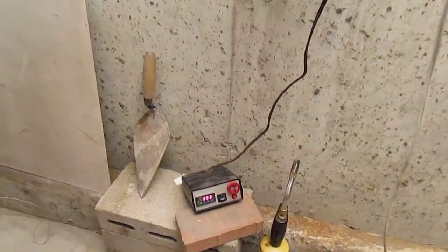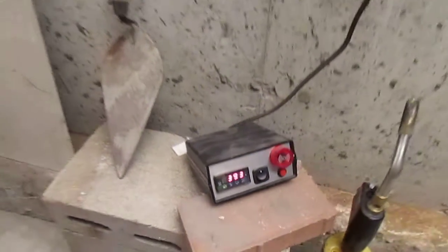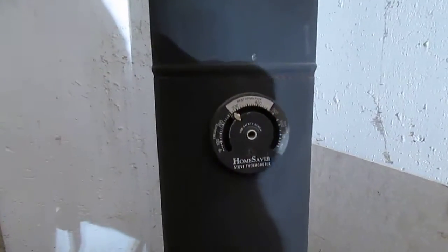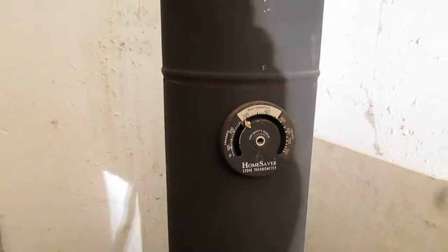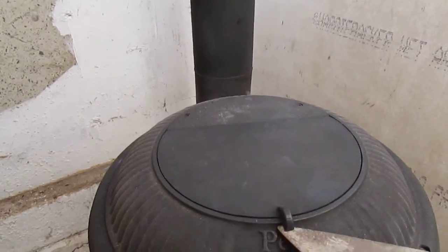Another 15 minutes or so and the temps are now up to 393 on the side. The flue is showing almost 300 — this one's a little above 300, probably because it's on the arm where the double seam is. I had the MPD open just to ensure it was going to get going, because when I was opening the doors earlier I didn't want any surprises.